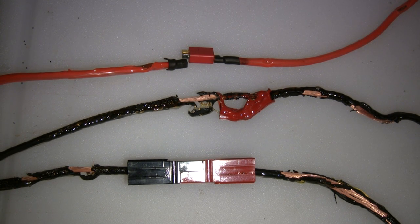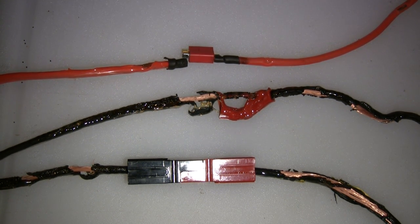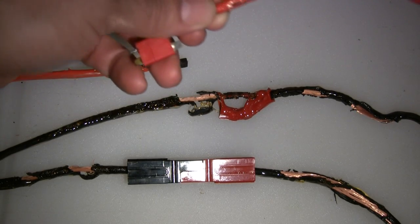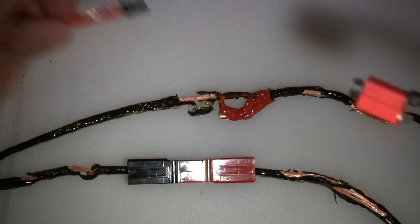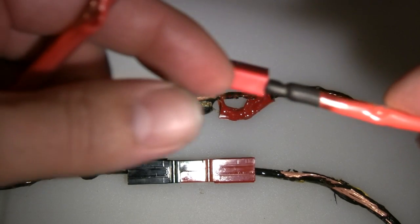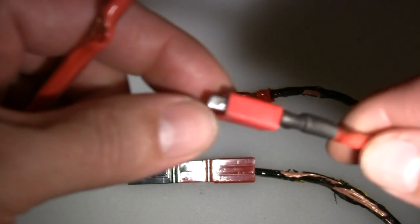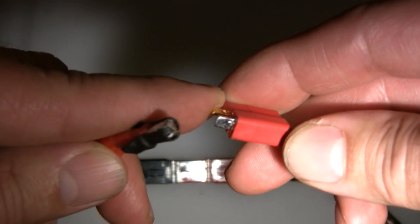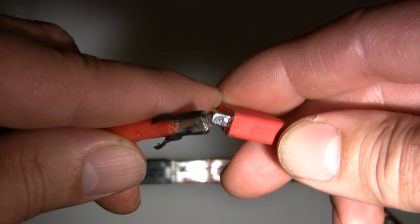The math of the Deans vs. Anderson Power Pole test of failure. The Deans was a little disappointing — probably a problem on my part. I do consider myself a very good solderer, but the Deans failed. Although it failed at up around 350 amps, at the solder joint.